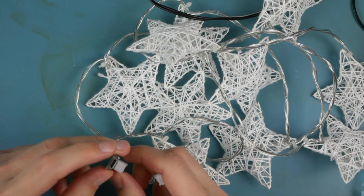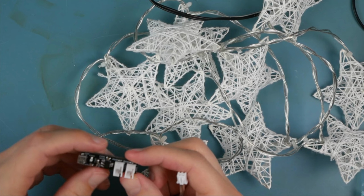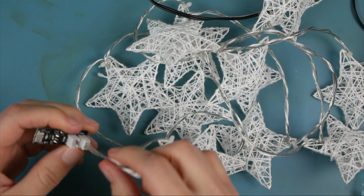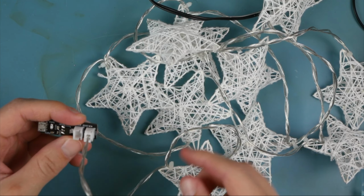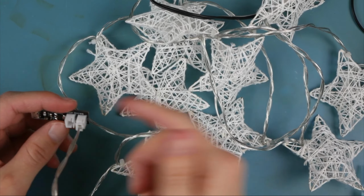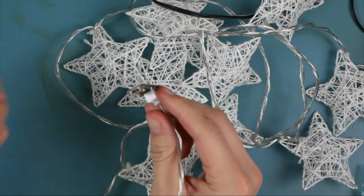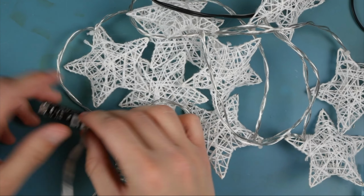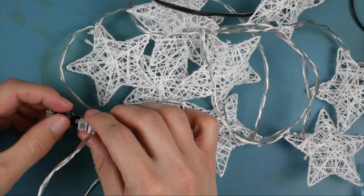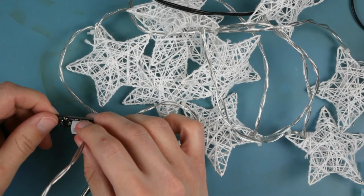I took a little board that accepts USB and converts it down to 3.3 with two little series current limiting resistors that drop the minuscule voltage required to go from 3.3 volts to right around 3 going into these LEDs, just limiting the current to a similar level. And this might seem kind of simple on the surface. Took basically a 3-volt battery pack, converted it to a 3.3 volt LDO. Maximum current is 500 milliamps through a fuse on the front to make sure I'm not going to damage anything.